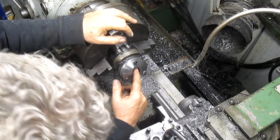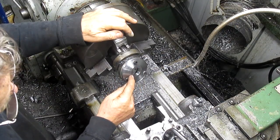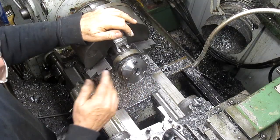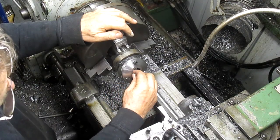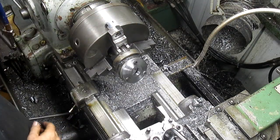to kiss this back edge first, what will happen is I hit this front edge on the back of the bit, and so the thing jumps around. So what I have to do is I have to come in and just kind of clean up the front edge a little bit, take maybe 40 thousandths or so off of that, and then start working on the inside edge.